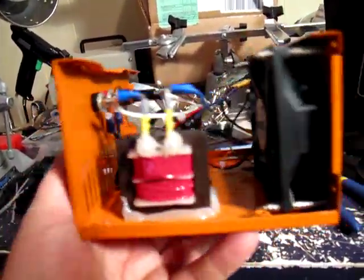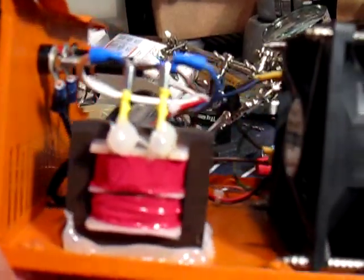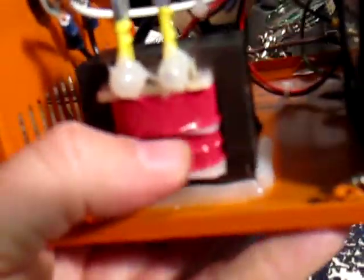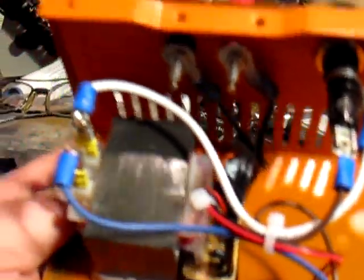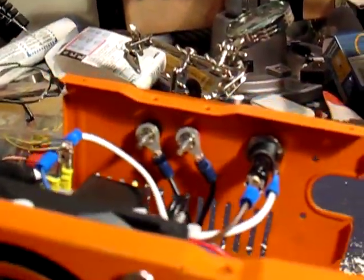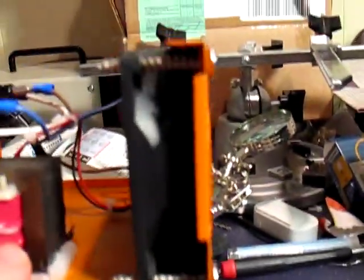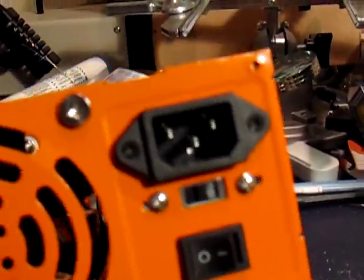I used crimp connectors, crimped right onto the 120-volt plug. This transformer came out of a black wall wart — I just broke it apart and soldered it in because I found it ran hot, so I wanted some cooling. Everything is basically zip-tied in. I used stainless steel screws to mount the fan in the back, rewired the plug and switch, and used yellow heat shrink tubing for insulation.